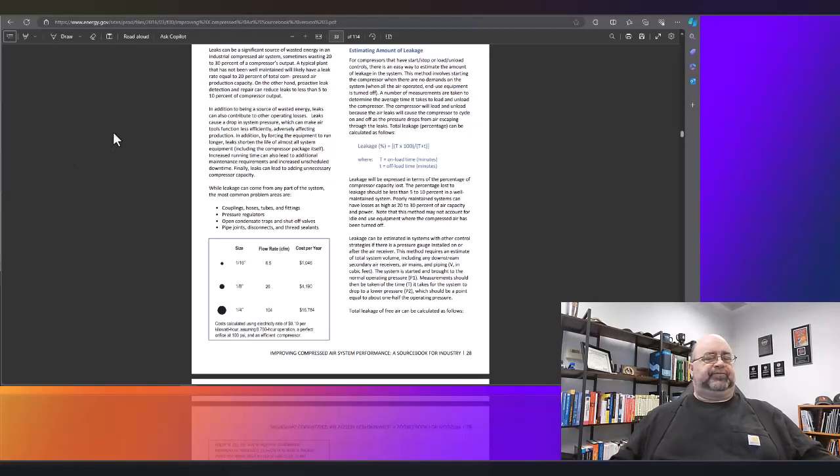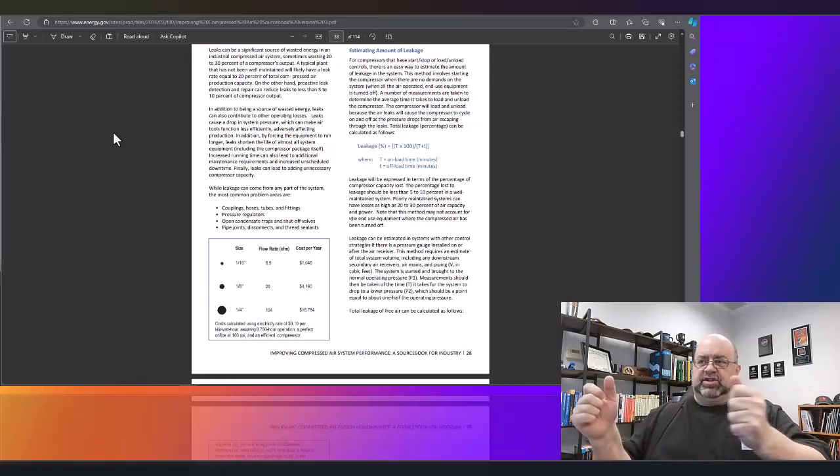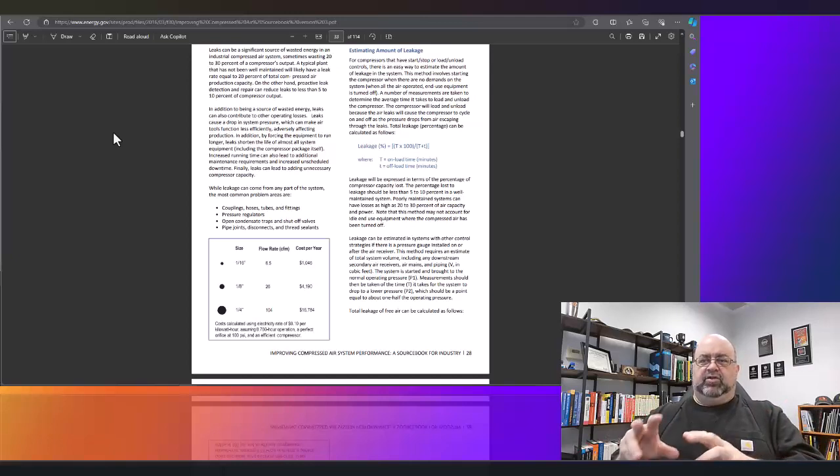Now, I've seen some conversions for ultrasound to air leak. Generally, those tend to be nice and conservative. I like ultrasound for air leak detection. I think it's a great tool for that. And they now have some that will actually map out the leaks. You'll have a device with a bunch of ultrasound receivers on the back and a screen on the other end, and you just point around, and it works kind of like infrared, where you get a color chart that shows severity, or basically helps you pinpoint exactly where the noise is located. Probably a tool I'm planning on investing in shortly.